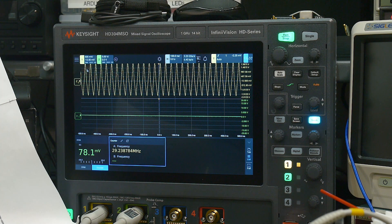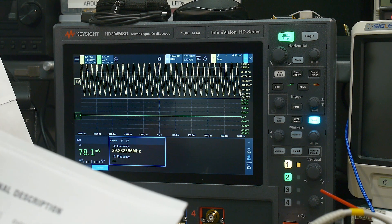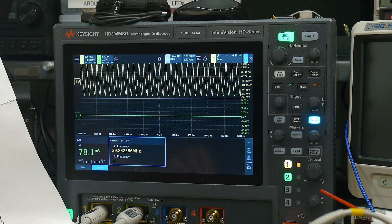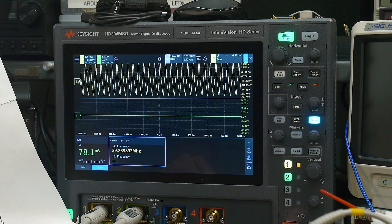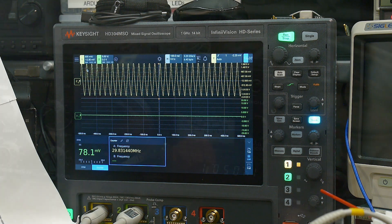When that transistor was starting to die, did people go and twiddle the knobs in this thing? Because it's a beautiful oscillation now, but it's not oscillating at the right frequency. I just got it to go 29.83 — that is the correct value. I did the IF shift on it, and when I IF shift it to neutral it's 29.83. When I shift it over it goes to 29.23, and when I come back to center it's 29.83. So it is working correctly now.